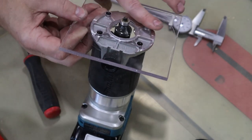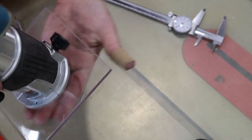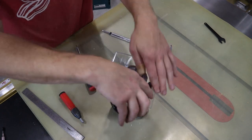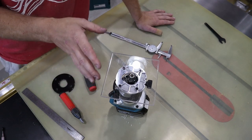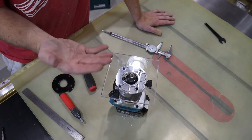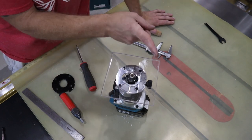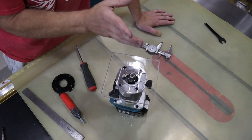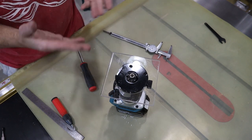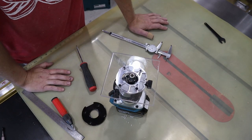There you go — you can see we have a nice flat surface. It's clear, and the screws aren't going to catch on anything. Now we have a bigger base compared to only having the original small footprint — we now have all this extra footprint to work with. Whether we want to cut dados, a rabbit joint, a lap joint, or something like that, we have more room. The only problem is we're not going to be able to use our guide system. But if we were using the guide system, a much larger piece of material would make that small foot sufficient enough. This is going to be great for edge-type work compared to middle work.